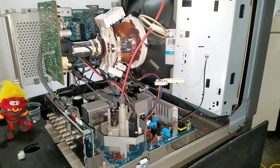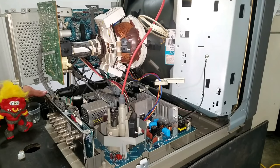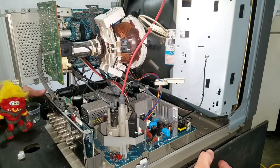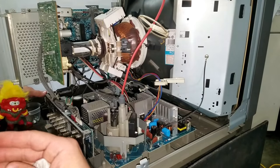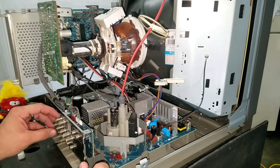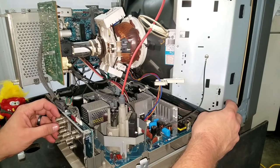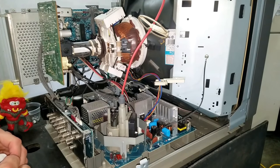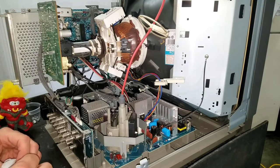I really appreciate you spending this time looking at the first half of this video on the 20L2. Let's just recap. We cleaned the screen bezel and tested it, and then our second step was taking the shell off, cleaning the inside, and inspecting the inside thoroughly. Now the last two things I see on here are to hook the Super Nintendo back up, and we'll run a full calibration on the monitor and get it set. Then we'll clean the shell and reassemble it totally, and it'll be ready to be put into service and used normally.